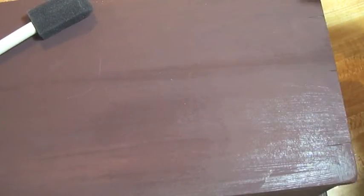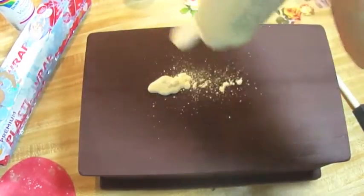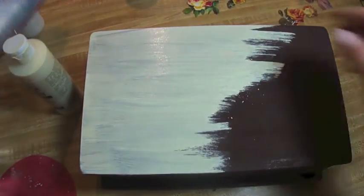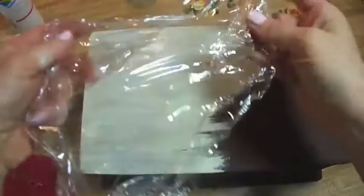My hands aren't very clean from that first coat. And with a lighter color, we're going to paint over top of the paint we just put on. But before the paint dries, we're going to take the saran wrap and do a little faux finish. You want to have your saran wrap ready and just work on one section at a time because it could dry quickly. Place your paint, and now while it's wet, tear off a piece of your saran wrap. Don't pull the saran wrap tight — the idea is not to seal it.